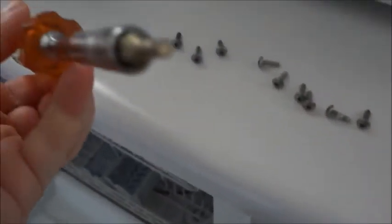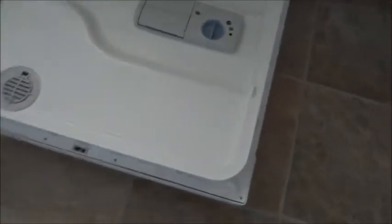First thing you're gonna want to do is take out these 11 screws — you gotta use one of these special bits. This is the Quiet Series 300 Maytag dishwasher with no power at the panel. Once you get that separated, the weight holds this down, but here's your safety switch. The circuit board is underneath where the wire comes in. From watching YouTube, this ribbon cable right here is probably what's bad — there seems to be a lot of corrosion on it.